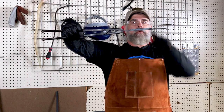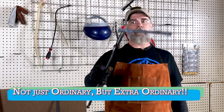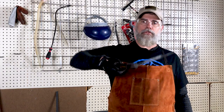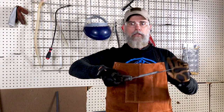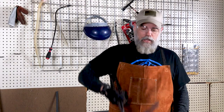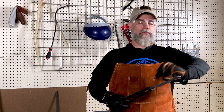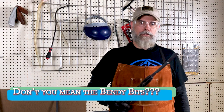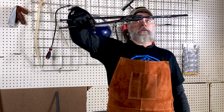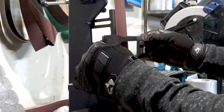I've got the shoulders put in and the handle bits tapered out. As you can see, it looks absolutely not perfect at all, and I'm still struggling with tongs — and it's still very hot. What I've got to do is let this cool down a bit and then take it over to the grinder and try to clean it up as much as I can. After that, I'll put it back in the forge, heat it up so I can round these handle bits over to give you something to hold on to. Then I'll get it heat treated, then tempered, then some more cleaning and we'll be done. It's got a little bit of a twist in it too now, but we'll make it work.